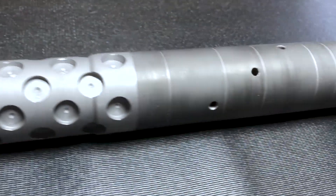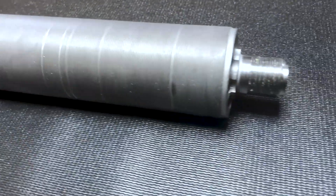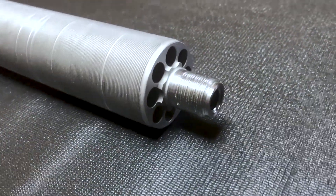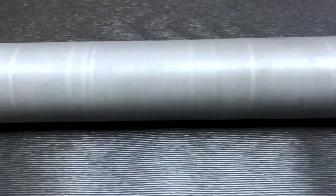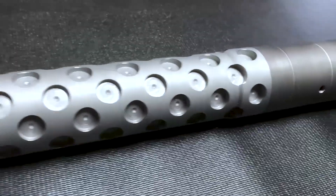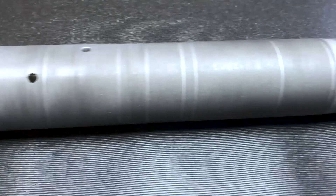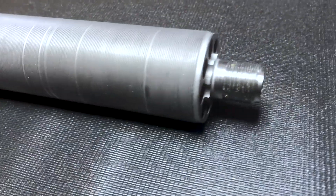So it's about what's the market, what's the goal that the end user wants to work with. But we will do further steps to actually break down harmonic resonance within the barrel to interrupt it. Harmonics can only work if it has a surface or material, a pathway that it can continue on. If you disrupt it by changing densities, by features, by shapes, then you break up the harmonic wave. And there are barrels that we will produce where we work further to break up that harmonic wave.